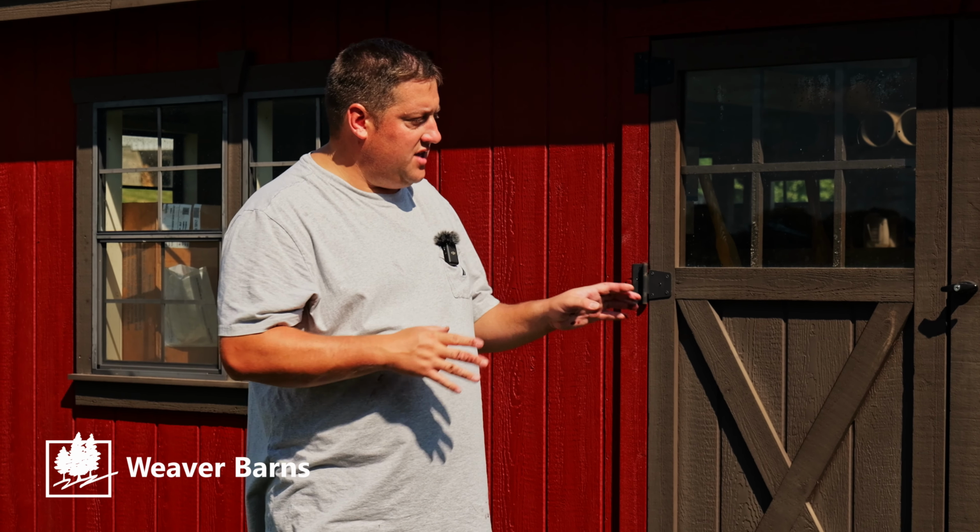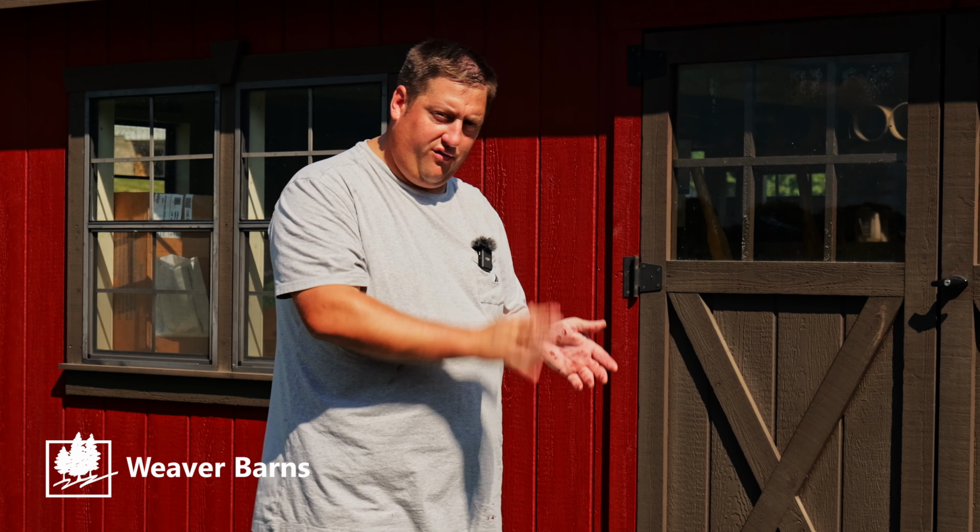And here's the downside of stains. Over time, your stain job will never look as good as it was new unless you completely strip the stain off of the product and redo it. So for instance, in log homes, after 20 years or so, a lot of times they'll come in, they'll corn cob to get right down to bare wood to get a fresh new stain job look.